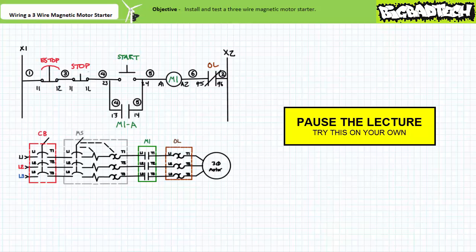Start establishing good work practices now. Quick hint — wire numbers are best thought of as nodes. You'll note wire four and five are pooled connections and only convenience dictates which terminal is physically employed to the best advantage.